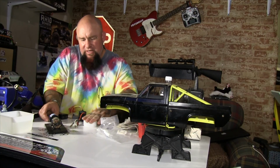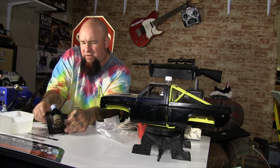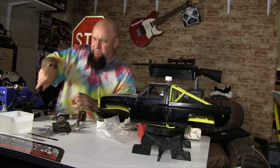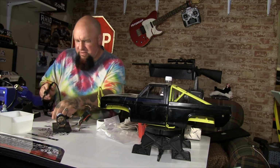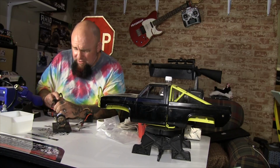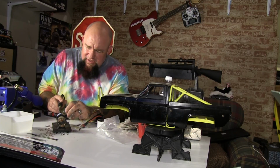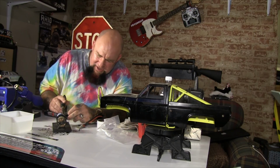And then if you're using your standard red and black wires like I'm going to be doing, pay attention to orientation. It's marked on the can which side's positive, which side's negative. That's my positive, so I'm going to go ahead and do that one first. Always be sure, these are already pre-tinned. I'm going to go ahead and just add a little more solder to them. Go ahead and tin my bases here. Doesn't take a lot of solder.